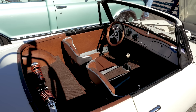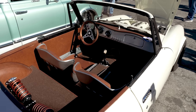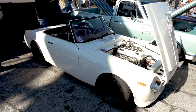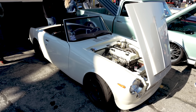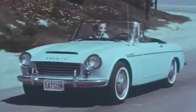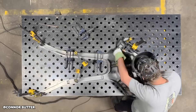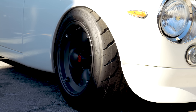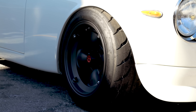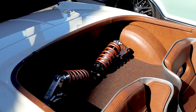Let's talk about the original chassis. These days monocoques are the norm for road cars, but older cars used body-on-frame, which actually gives a lot more flexibility for custom fabrication. In terms of problems with that original chassis, the front suspension has a weird geometry that kind of points back — you can't really get a good stance or good performance out of it. There were also factory rear leaf springs, and it takes so much work to modify that to drive like a modern car. Suspension technology wasn't where it is today back in 1969, so there are a few gremlins to iron out.